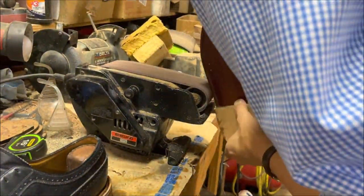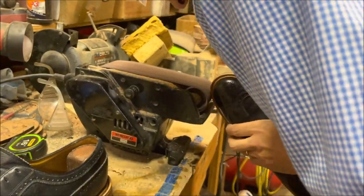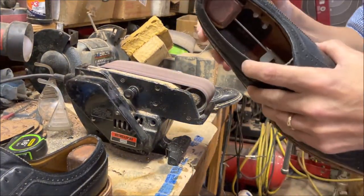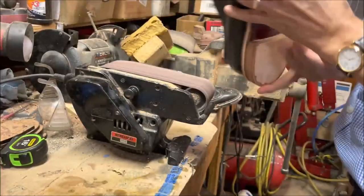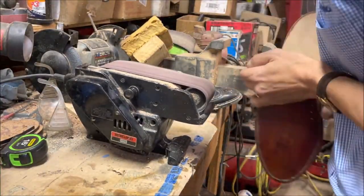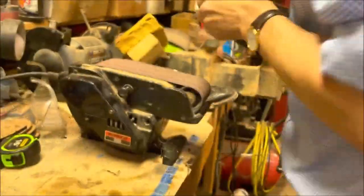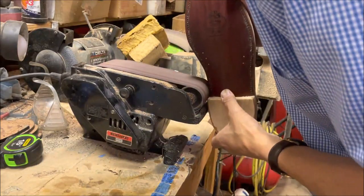So here's what I've kind of figured out. You get the best control on the front cylindrical edge, although it is the harshest contact. It's a line contact, which is really, really difficult actually to get a curved surface from a surface that's curved the other way. You gotta have a really smooth hand as you're drawing the heel in an arc. If you push too hard at all, it digs right in and makes a gouge.